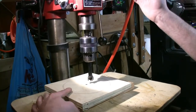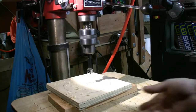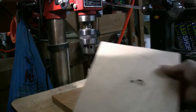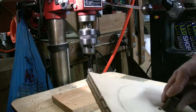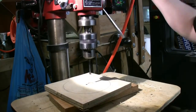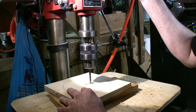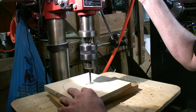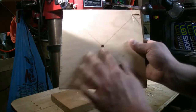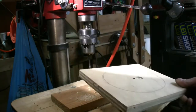We're going to drill partially through with the three-quarter inch bit, just enough so that we can recenter it, and then we'll continue through with our quarter inch bit. Our quarter inch bit is now in and we can center that with the pinpoint from the three-quarter inch. Now that that is done, we will redraw our circle using the plate of the router.